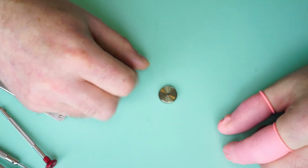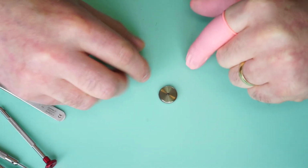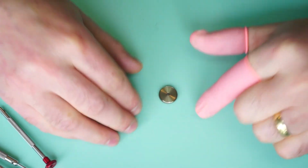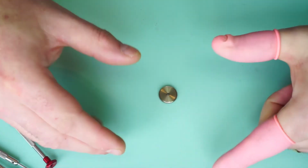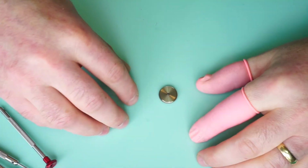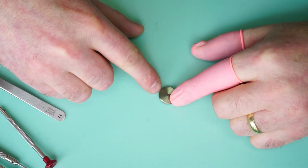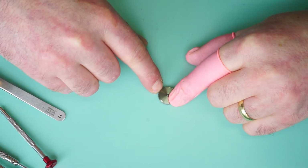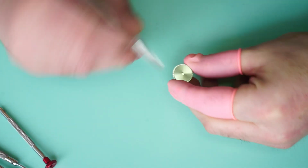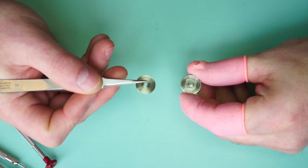And last but not least, we're going to do the mainspring. Now some people like to remove the mainspring entirely and clean it separately. I like to just remove the cover and the arbor and clean the whole thing, the machine, and then hand clean it afterwards, which I'll go over probably in the next video. But in order to release the mainspring, you can just pop the cover off like so, then using tweezers just get under the cover and we've released the lid there.